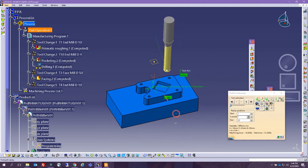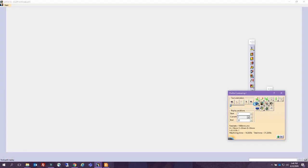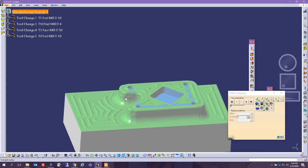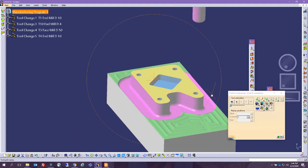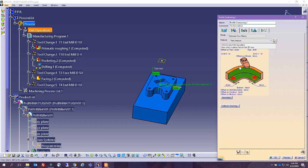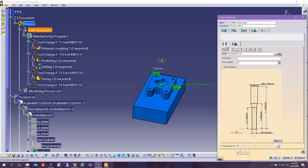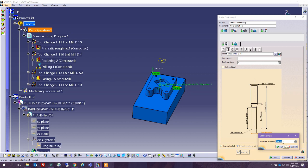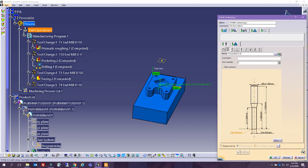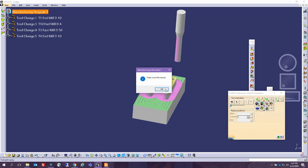And this is how it's gonna look. So of course the arrow tells you if it's the inside or the outside. All right, perfect. So let's go ahead and play the video, and I'm going to change the tool in a second. And so, all right, it is perfect. So I'm going to remove the corner radius. So I'm gonna pick a tool without a corner radius. So going back in here, we can actually say, hey, we don't want our tool to be a bull nose tool. We can pick another tool. So we've been doing radiuses of, I think 5. Yeah, 5. So a diameter of 10 would work well everywhere, no problem on that, especially on this internal portion. Let's see if we need to change something else. No, we don't need to change anything else. Let's go ahead and play the video and associate the result.